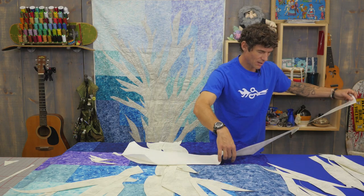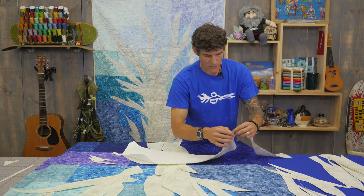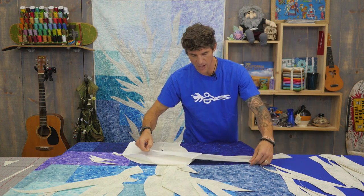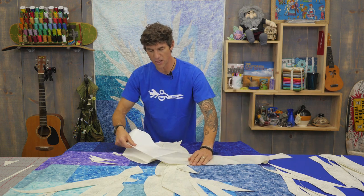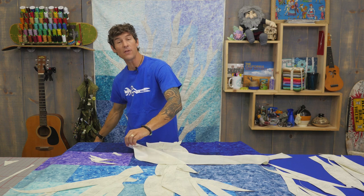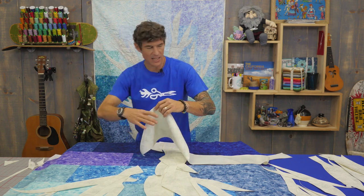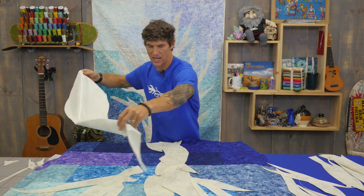That will often help you fold it. And then as you start to get in here with your fingers or fingernail you can see the sheen — so the glue is right where it belongs. If you find that the paper is not peeling cleanly and you're getting weird blisters and bubbles, you can take that piece back over to the ironing board, make sure you're protected, hit it again for a second, let it cool, and the paper will peel off nice and easy.